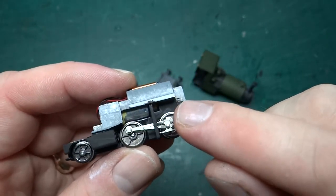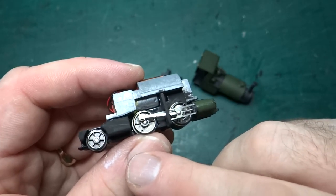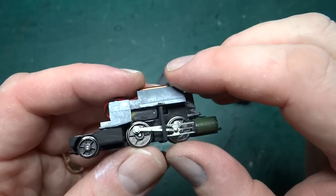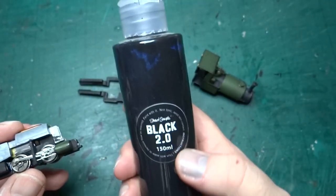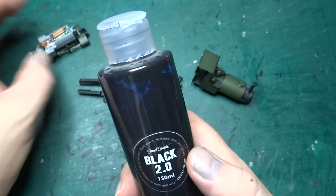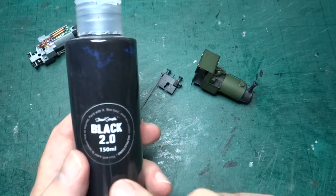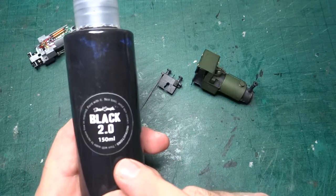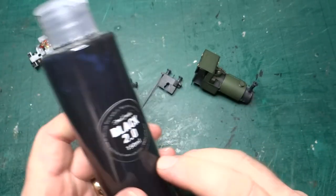Once I got the circuit board sorted, I tested it, then I also tested it with the cylinders on and it runs nicely. I'll try and put a video in here as we talk about it - it shuffled up and down my test track quite nicely. I've gone back in and redone the black paint. I wasn't happy with it. I'd added some black primer to the edges last time to try and get rid of some of the shiny effect, but it looked a bit streaky. So I've gone back in and used Black 2.0 by Stuart Semple.